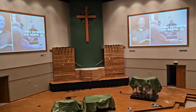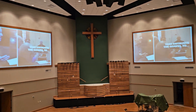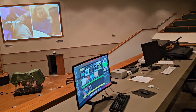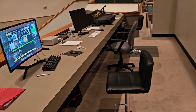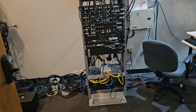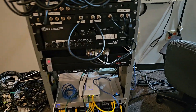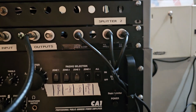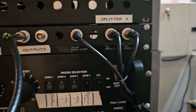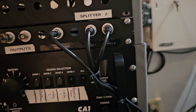We're here at Second Baptist in Arkadelphia. What we've done is reformatted our screens from a 4:3 ratio down to a 16:9 ratio. We took a new SDI cable from the presentation Mac up to our video production room — basically an HDMI out converted with a mini converter to SDI — then brought it into the patch bay. We've got it labeled as 'presentation computer' with outputs to projector one and projector two.